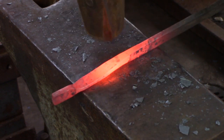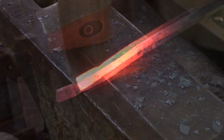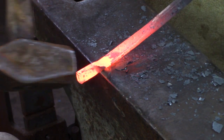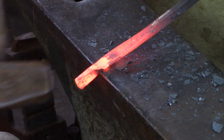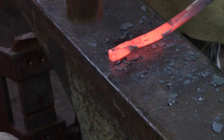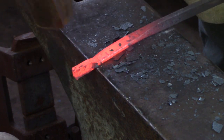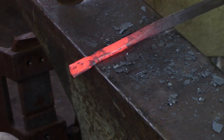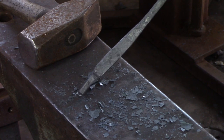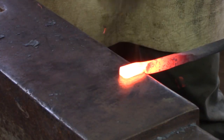I'm using the hammer and the edge of the anvil to isolate the material for the thumb pad. I feel a guillotine type tool divides the material too much and robs me of material width for my eventual outcome. To sharpen the transition I use my hammer and the sharp edge of the anvil. Here is the result thus far as I head into spreading the thumb press over a soft edge of the anvil.